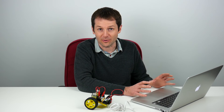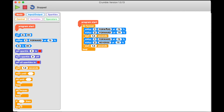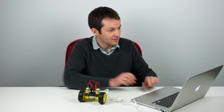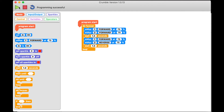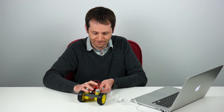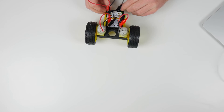Let's see if we can make the robot go in a square. I'll say both motors forwards for one second, then motor 1 forwards and motor 2 reverse for one second, and put that inside a loop. The robot should go forwards for one second and then turn for one second. We'll turn the battery box off, program the Crumble by pressing play, then unplug the Crumble. When I turn the batteries on, it will run the last program we sent to it.